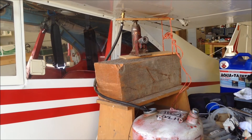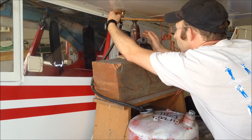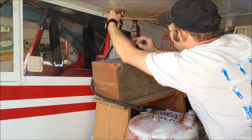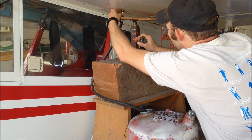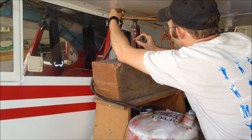I've already drained some of the fuel so there's only a few gallons left. You get it set up like this and then hold the fitting so it's just right around the bottom of that fuel sump. Then slowly and carefully raise the jack up, making sure it's right around the bottom of that fuel sump. Make sure to hold the fitting so it doesn't slide off the fuel sump sideways, allowing any fuel to leak out beside it.